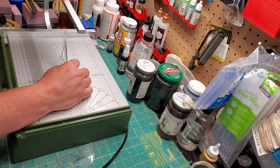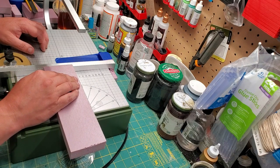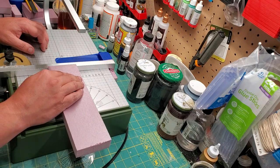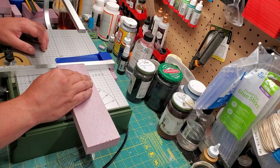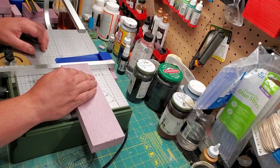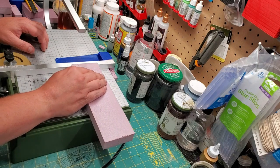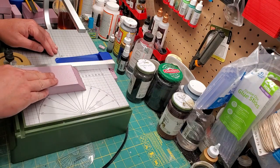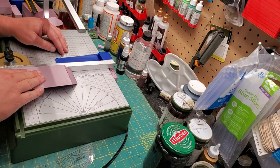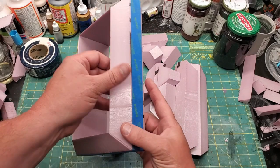Now let's make it really complicated. I'm going to cut off some 45-degree angles from the ends so that I can miter the joints — in other words, make them come together at an angle. I'm going to do that on all the ends of the pieces. I'm also going to do it to the outside edges to give a bevel, as you see here, coming down towards the center. And that's kind of what it looks like when I'm done.